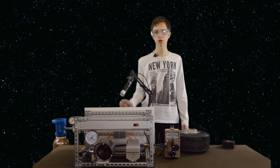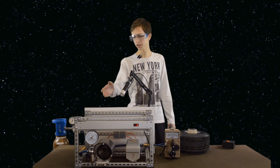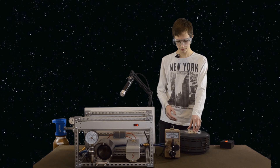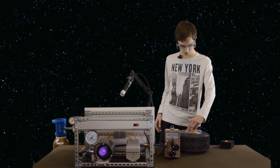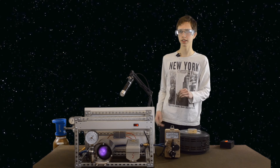So this IEC FUSOR is called a demo FUSOR. Despite the fact we don't use additional fuel and won't get a fusion reaction, there is a chance to produce ionizing radiation. So we are working with a low energy of 5 kV, which produces ionizing radiation that does not exit the reactor vessel. Now the chamber is vacuumed and we can turn the process on. We'll slowly increase the voltage on the variac — that is a voltage of about 5 kV or 5,000 volts. And here you can see the plasma in the reactor vessel.